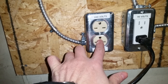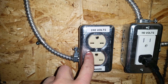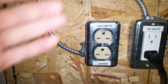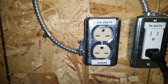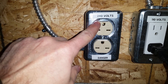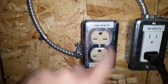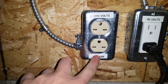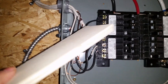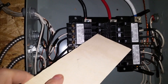Note that I've switched the order — usually in houses with 110 volts, the ground faces down, but for 240 volts I've put it facing up. If you've got a tool that falls — a screwdriver or something — and the cables are half out, you don't want to catch 240 volts. So put the ground facing upwards. It's a tip that keeps coming up in everything I read. I've got teenagers in the house, so don't mess with that. These cables are going into the box.